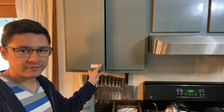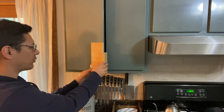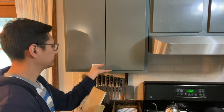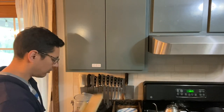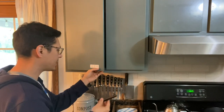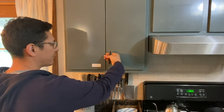This is a left-side and right-side, one-size-fits-all kind of jig. I stick it on the right side for a left-facing door — this piece from the side, up there, no wiggle, it's secure. Then I drill my holes and flip it around for the other side — same plane on both sides. I stuck the handle through the hole as a sort of fake punch-through. I kept the protective film on the door for a little extra buffer in case I goof it up. Now I can see the marks and bust out all the holes real quick, then start on the drawer fronts.